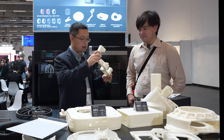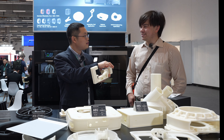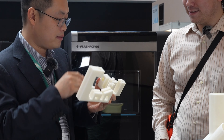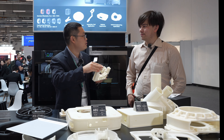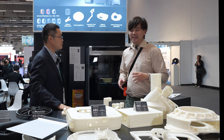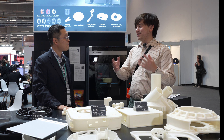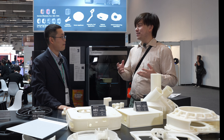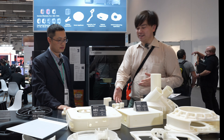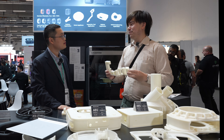You can see this model — it looks strange, right? It looks like a wiring harness or maybe a gauge to test if a part was manufactured correctly. This part is used in the car industry to install the tube for the air conditioning. These are manufacturing aids. 3D printing has really been a boon for that — it used to be you had to build tools by hand or send drawings to a machinist, but now a designer can use geometry references from an existing CAD model to make a perfect installation aid.